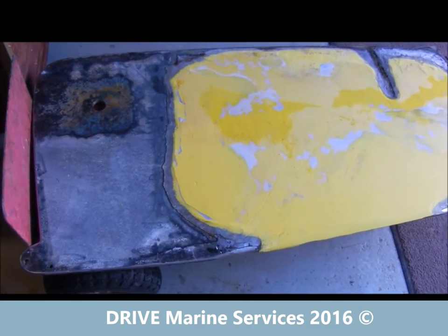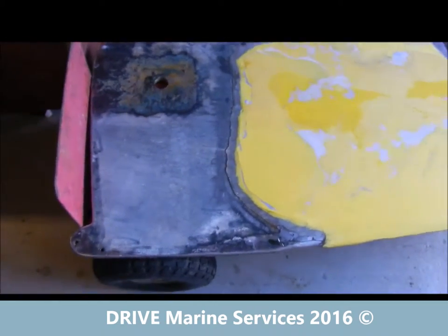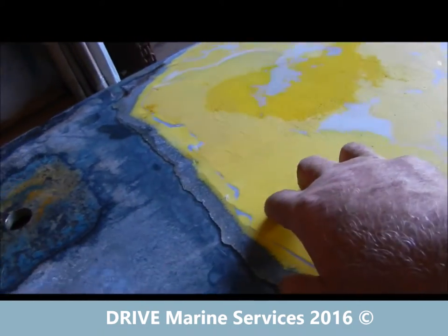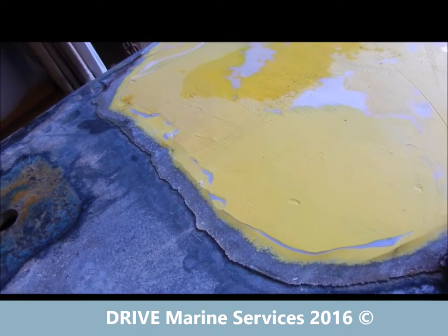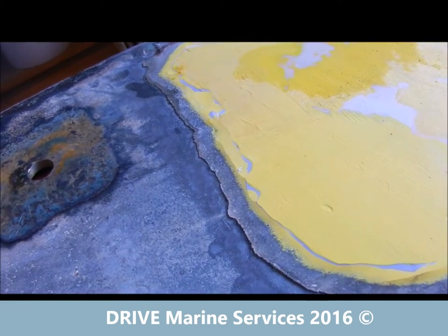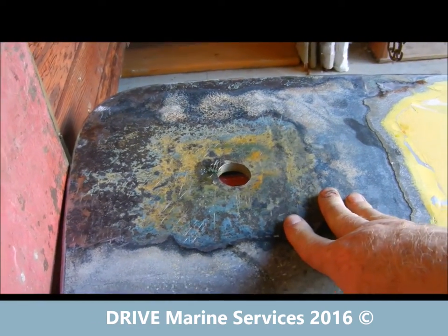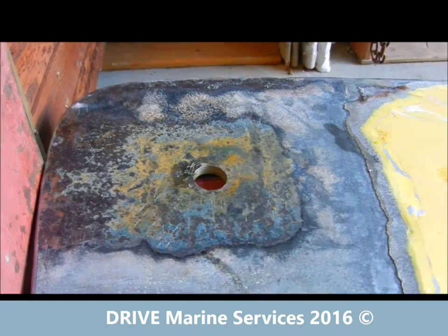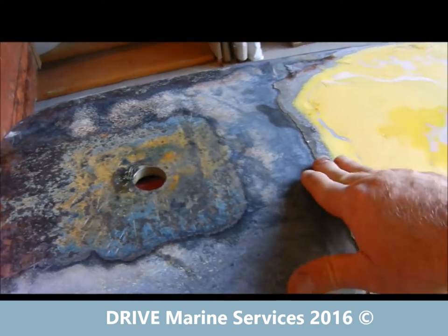The board's been cleaned up now — there's still a couple of spots to go. There's a little bit of rust, and they never rounded the corners or edges up near the top. As a result those sharp edges caused problems, because coatings don't like sharp edges. You can also see here how it's pulled away — they used polyester resin to glue it all together. Polyester resin is a very poor adhesive; they should have used epoxy because it's an excellent adhesive and pretty well waterproof. That's why we've got all this rust. This side in particular is down at water level, so the water permeated through. We can just peel it off and you can see how it's pulled away — but we'll feed some epoxy in under there and that'll lock it all back together.